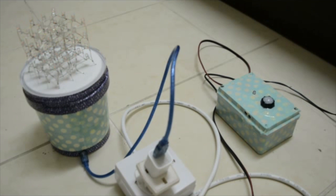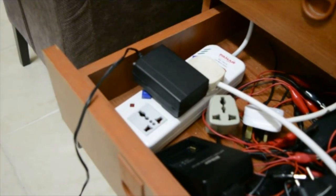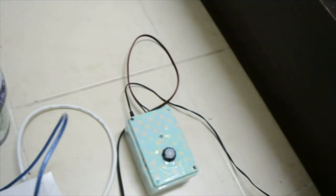Let's see that in action. The circuit is connected. Right now the motion sensor has turned off and the LED is on, indicating the sensor is not triggering anything. As soon as I put my hand in front of the motion sensor the circuit will trigger. There we go — as soon as the motion sensor turns on the LED turns off. It stays on for about four seconds, which is the time delay I've set.